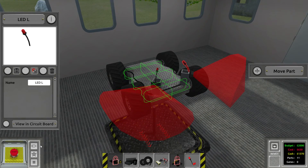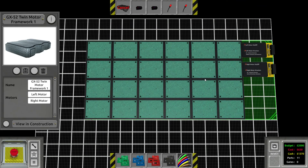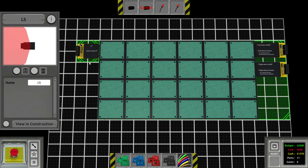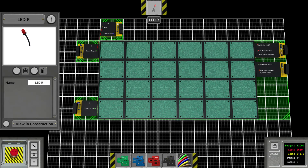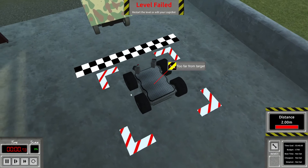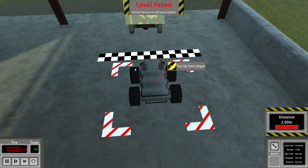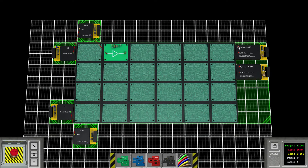I think that is actually everything we need. Let's put the body right here and use the left sensor first, then left LED, and then the right sensor with the right LED. Let's think about this practically: if we don't detect anything with either sensor, we want to go straight. If we don't detect anything with the right sensor, we want to go towards the left side, and the other way around with the left sensor. So if the left sensor does not detect anything, the left motor goes, and if the right sensor doesn't detect anything, the right motor goes.